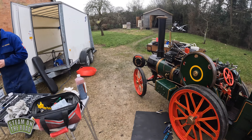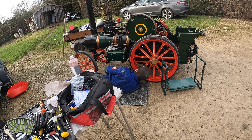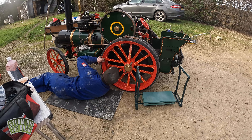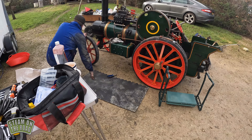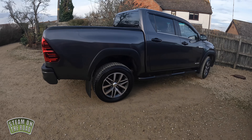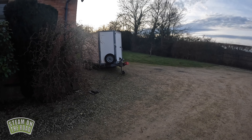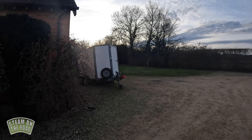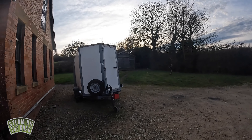Luke came over and we had a day updating the engine — giving it a good going over, putting it together after the winter, and changing out the drain cocks because they were a bit tired. We also found a problem with the fusible plug: the previous plug had only been in about three threads, and there was a calcium build-up above that, so we had to put a tap through to try and solve the problem. Today is Thursday evening and I'm getting ready to head down to Cirencester tomorrow to see Simon Nuttall. He's having a cold test done on his Fowler A4 — not Foster, as I kept saying before. Let's go and see what we've got.